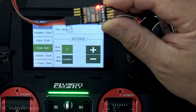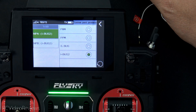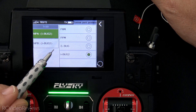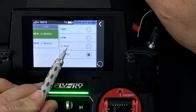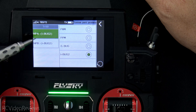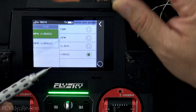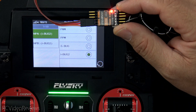Now let's take a look at some of the configuration options you have on the transmitter. If you hit the back button and go under custom port protocol, you'll notice on the left-hand side there's a new port A and new port B. I set both of those up for iBus2, and that allows me to connect sensors to the NPA and NPB tabs on this receiver. You can also choose SBUS or PWM outputs. If you set the new port channels for PWM, enabling NPA and B gives you eight PWM outputs. If you set them for iBus2, you'll get six PWM outputs and two serial stream inputs or outputs.